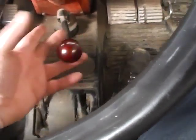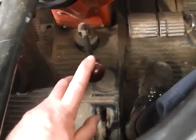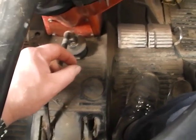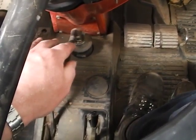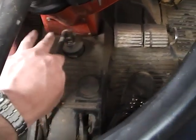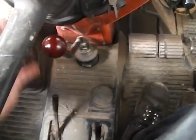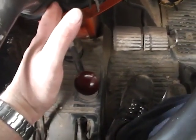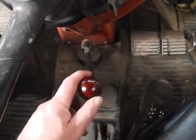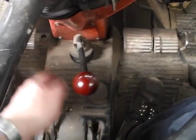This one, standard gearbox, 5-speed with reverse, but it's actually got a dogleg first. So again, people say, oh, my car's got a dogleg first. Yep, so has my tractor. Basically your first and your reverse line up in a straight line, and then it's up 2, 3, 4, 5. No synchromeshes on them, other than 4th to 5th, so the rest of the time you have to double clutch it.